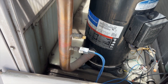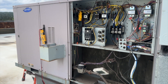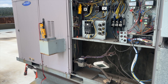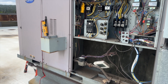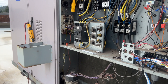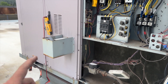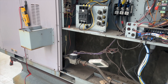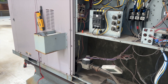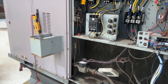We can at least run our second stage, so we'll jump Y1 to Y2 until we can get the other one fixed. Compressor 2 is running and the system is cooling — it's only at half its capacity. I talked to the client and they told me not to look for the leak. They just want to run it like this because they already have plans on replacing the unit in the fall. The only reason they did the fans was to buy time. At least it's sort of cooling. Hope this helps — thanks for watching. Make sure you like, subscribe, comment, and hit that bell notification. Follow me on Instagram and Facebook.